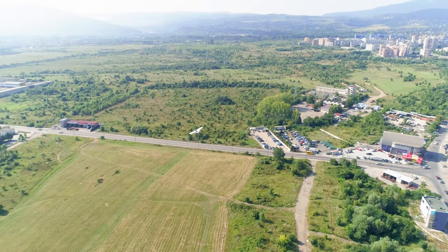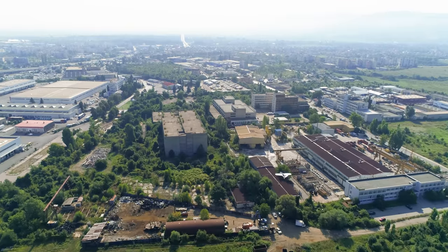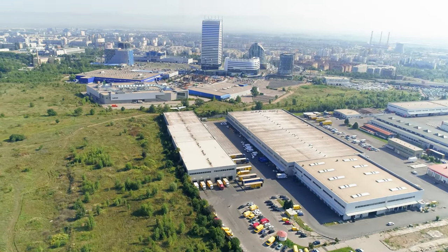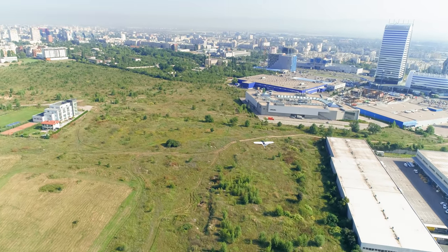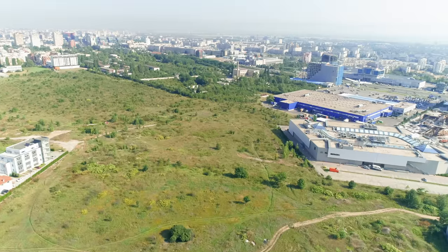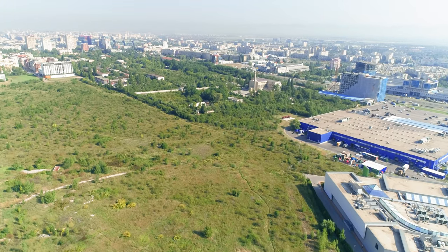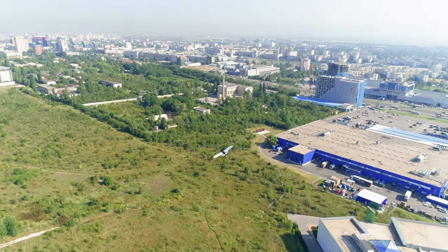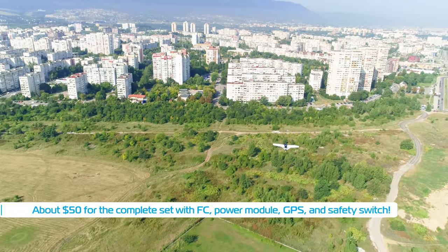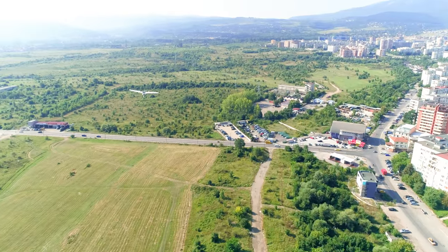As for the MiniPix, it works great and just as good as any other Pixhawk that I've tried. The only issue I saw was a slight delay in the OSD overlay update — I would change a flight mode for instance and it would change in the flight controller, but the OSD at times would take up to 10 seconds to reflect the change, and the same would happen with a few other items on the display like the altitude, the home arrow, and some others. It does not really present a problem — the autopilot itself seems to be functioning perfectly and immediately reacts to commands — it is just this delay with the OSD update times that is a tad annoying, and I will try to figure out if it is from the OSD firmware version or perhaps the telemetry that is also connected there causing this effect. In any case, the MiniPix is a neat little unit and by far the cheapest Pixhawk around, not counting the Omnibus F4 Pro boards of course, but unlike them it is mostly plug and play and can be installed quite quickly if you are not looking to create a masterpiece of wiring.